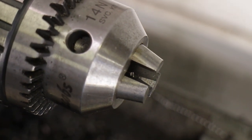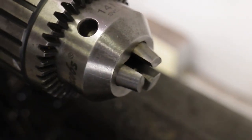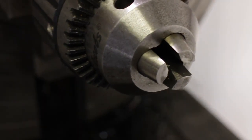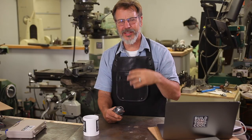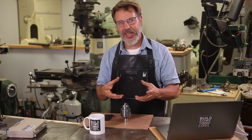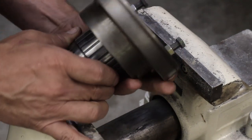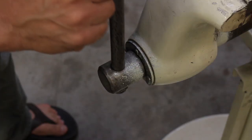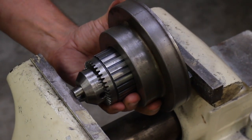If you can see here in this image, you can see just the end of this chuck — there's a little triangle right there. That's the real wear that was on this, and I could use the chuck the way it was but I just never really liked it or trusted it. The first thing we need to do is open up the chuck and clean out all the grease and any grit that may be inside that would prevent these jaws from actually seating into the body of the chuck.